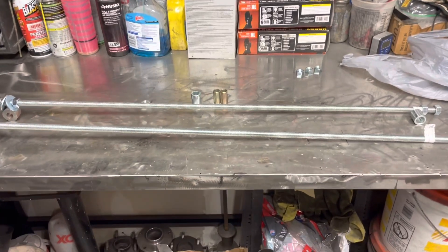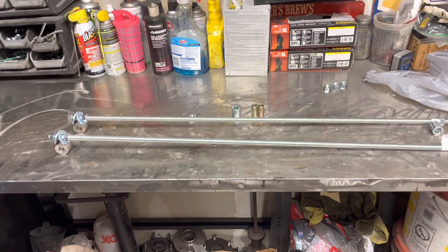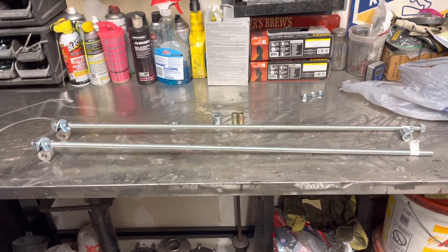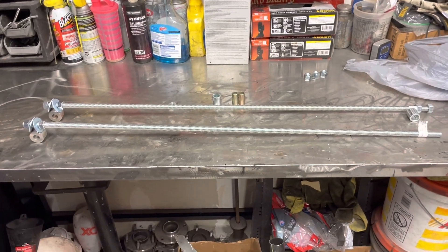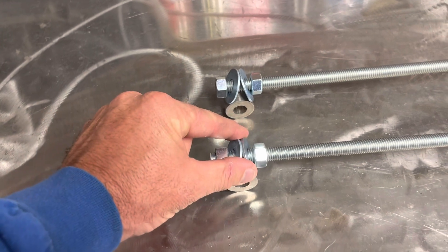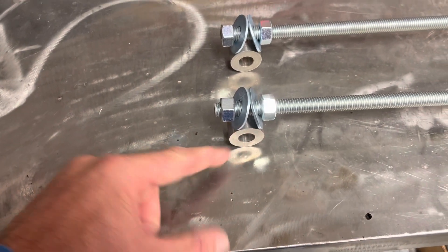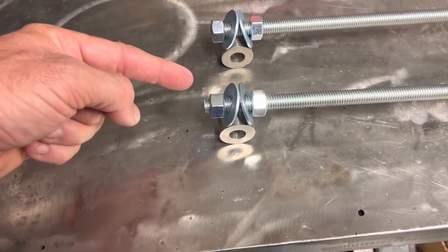What I figured is I need something that will be fixed at one end and adjustable at the other, and a piece of all-thread would be perfect. So I'm going to cut this in half, use this for the rear, weld these two nuts in place, weld this washer and this small little A-frame with this steel bushing, so that it will spin freely within this little setup.